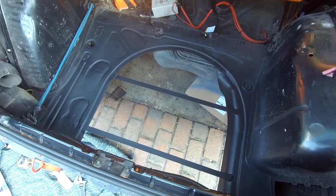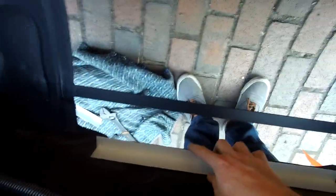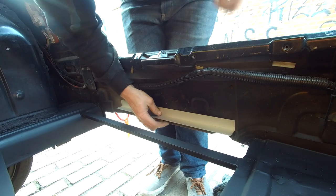I got a little impatient — it's currently in matte black. I hate it, but the bars are welded in. They're all welded, painted underneath, ready for a bit of seam sealer. So next up is mounting the way the panel goes to the back panel. I was trying to fold that profile — hasn't worked. What I've come up with is a bit of extruded angle on the back panel.